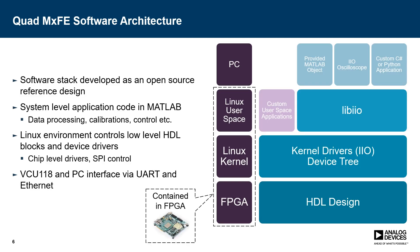The software is also a key piece of this product. We're developing a software stack that is an open source reference design, consisting of everything from the FPGA level HDL through the Linux environment all the way up to PC-side end user applications. The FPGA design is all written in Verilog and is open source. The Linux environment runs inside a soft-core MicroBlaze inside of the FPGA, and features kernel drivers and a device tree. The device tree essentially associates the drivers needed for a particular SPI device or JESD device within the HDL with an associated chip. At a level above that, in the Linux user space, we use libIIO, which is an open source framework developed by Analog Devices for communicating with these lower-level kernel drivers.